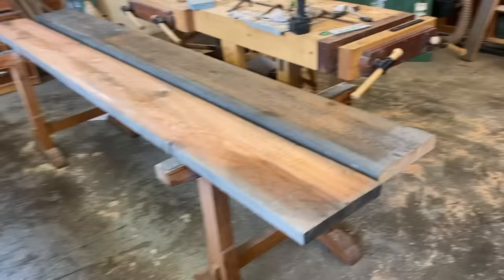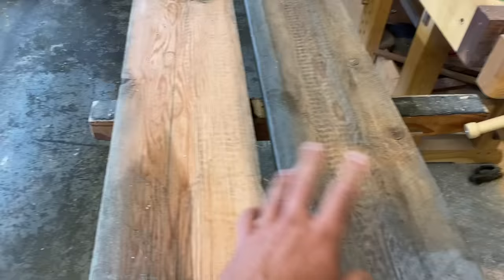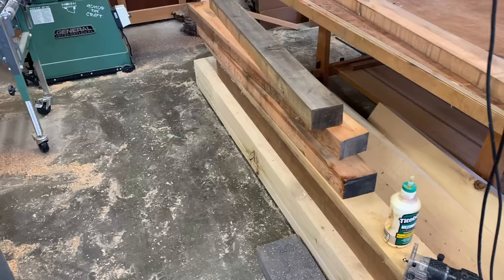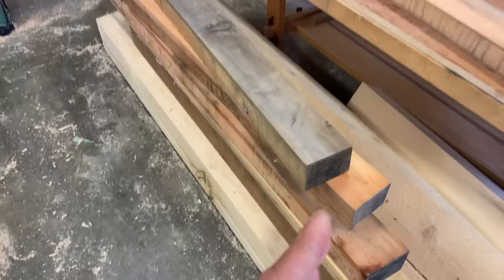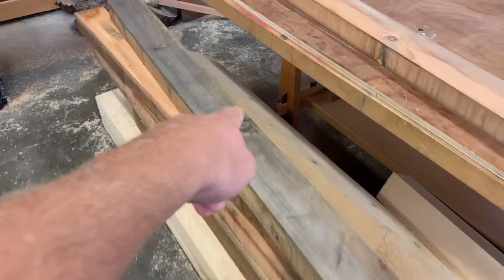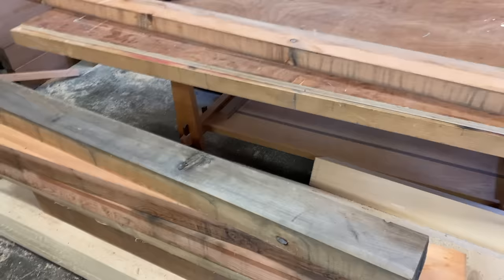All right, so all the wood that I'm using to build these windows is wood that I've been squirreling away for years. Big timber lots that I got deals on, I've just had stored away in my upper loft here. So I'm going to resaw these. I think they're 4x6s. And I'm obviously trying to use good lumber, no knots, especially for window frames. But I only got what I got, so I have to try and orient the wood in the best possible way to hide knots and that sort of stuff. But hopefully when I split them in half, there'll be one good side at least.